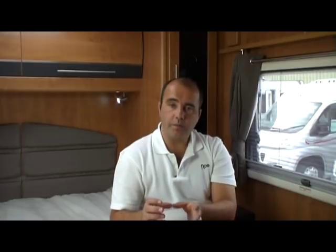Now, I'd like to just describe the procedure to you. What we're going to do is build up pressurized air into the system, and when we go to our first tap, the pressurized air will push that water out of that particular tap. We then close off the tap, build up pressure one more time, and then open the tap that's next to it. So it doesn't really matter whether you start with the hot or the cold. I'll do the kitchen first, then I'll move on to the bathroom for the wash hand basin, and then I'll do the shower. But you must drain the hot and the cold separately, because there are two pipes leading to those particular taps and you need to drain each pipe individually.